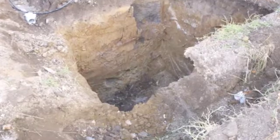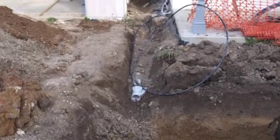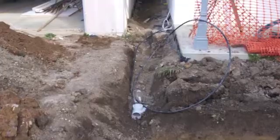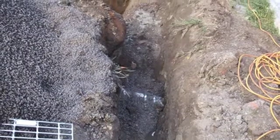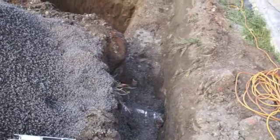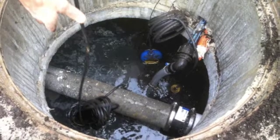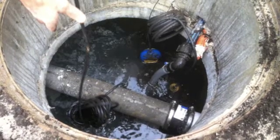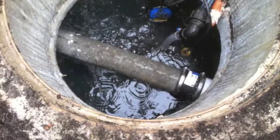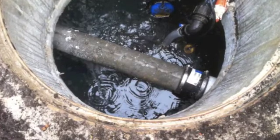In the next clip you'll see the stormwater drain running from all of the downpipes on the house into the tank under a plain gravity feed. I've got Leaf Eater leaf guards on all of my downpipes to ensure some coarse filtration before it gets into the tank, and then once it gets into the tank from DTB Pumping in St Kilda Road in Melbourne I've got their inline filter — that's a finer filter running in the stormwater line into the tank with the water dropping out the bottom. It's a very good system.